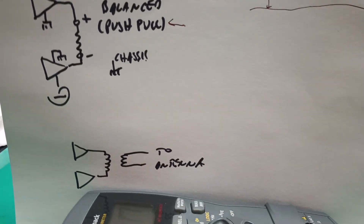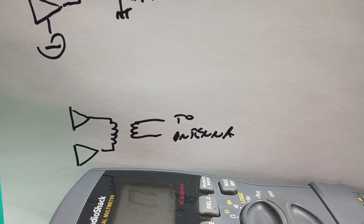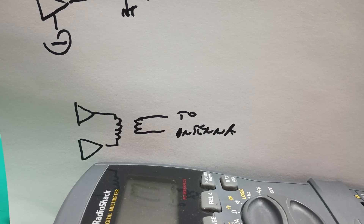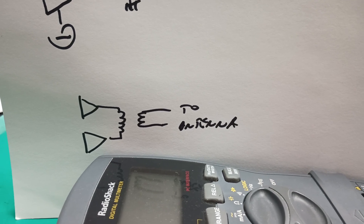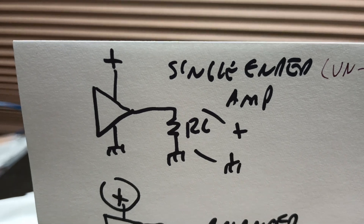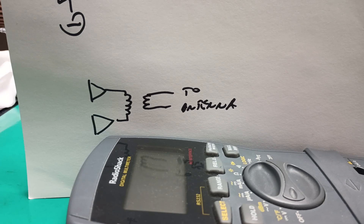In the old days, we'd have two amplifiers with a link coupling setup — a big coil to the tubes and a smaller coil on a rotary shaft as a rotatable coupling. That coupled to the antenna without regard to ground of any kind, which is why we could get away with grounding antennas back then but we can't now. Because now we ground the antenna connected to the single end of the amplifier, we've grounded the chassis of the radio and violated electrical code. Ham radio concepts of grounding are stuck back in the 1930s.